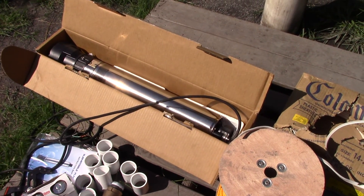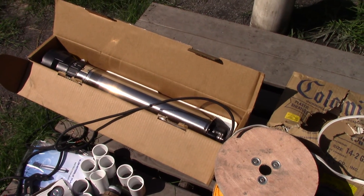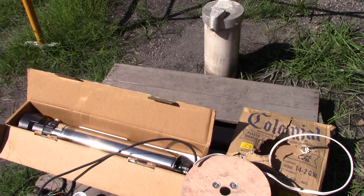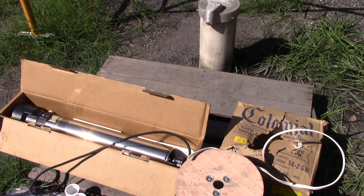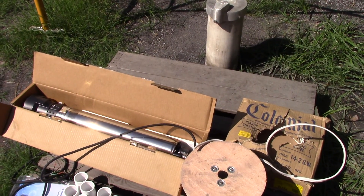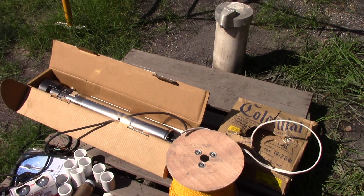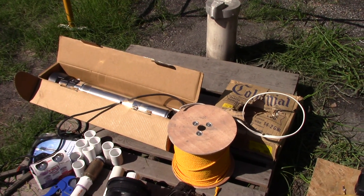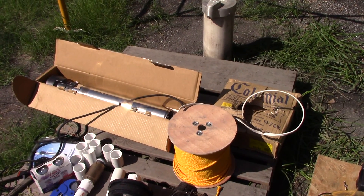It will go down to 220 feet and the electric power consumption will be roughly 900 watts. So my solar system will be able to handle that. The well itself is 200 feet down, but I'm going to go down to 190 feet with this pump, because you want to be at least 10 feet off the bottom just for debris and such. So we're only going to go to 190.